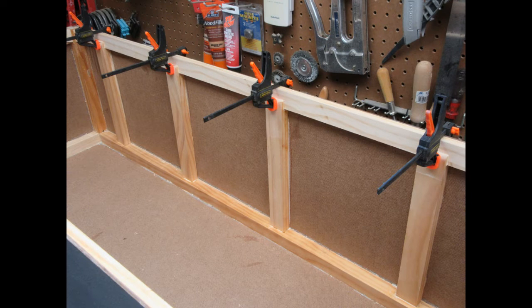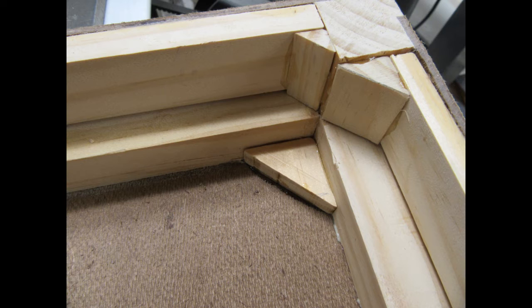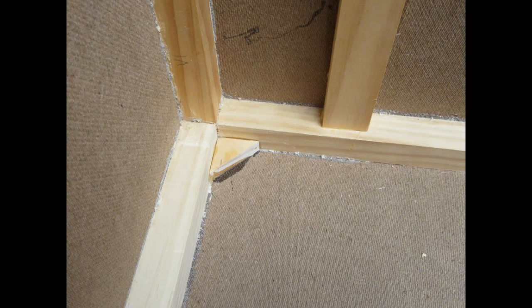I use epoxy or wood glue to secure the rails to the frame, and the glue is also liberally used to bond the rails to the back side of the masonite. Small beam clamps hold the rails in place during gluing. Thinking ahead to when I will attach the corner reinforcements to the case, I realize that one of the 3 screws on each corner reinforcement will go into masonite, which by itself cannot hold a screw. So I place 1/4 inch thick wood fillets at frame intersections where these screws will be. They are epoxied in place.